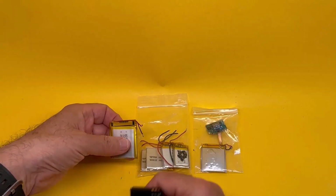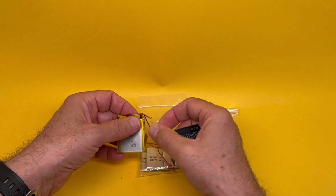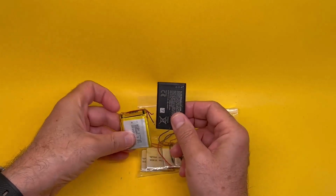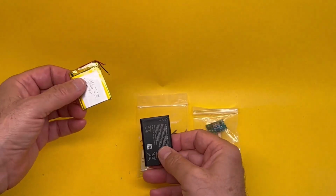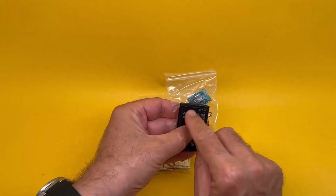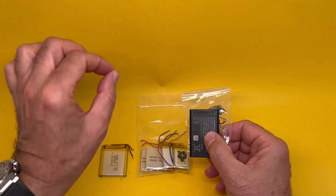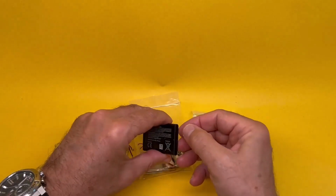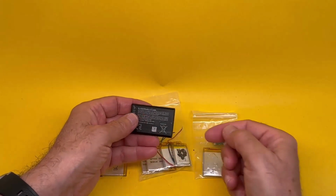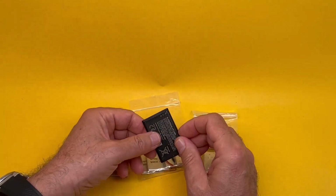So what you do is you find the right one and you solder those two to the right ends of the cable that runs to those, and hopefully it's exactly the right size. This doesn't happen to be the right size, maybe that one is the right size, and you put that inside. Okay, then you have to restore the casing. If you've done an amazing job, for example, if you've managed to just cut open the bottom of this and you fish out the original lithium polymer, this will fit right inside of it, and you can restore it very well, put it inside, and it should work.